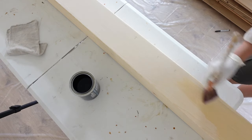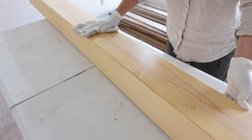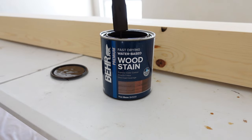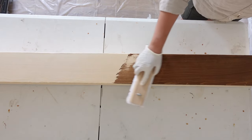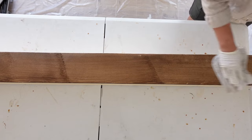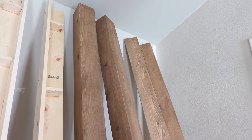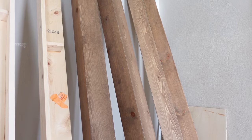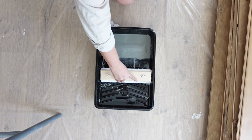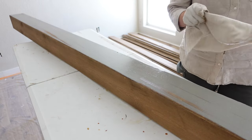After the beams are assembled, it's stain time. I'm using the same method as I did with the tongue and groove — bare water-based pre-stain, and I ditched the blue staining pad for a brush. It's way easier to apply and then immediately wipe after. I usually do one side at a time. After 20 minutes of drying, I stain the beam with Behr tamarind. If you didn't know, pre-stain has a window of use, so don't wait too long. I applied the stain with a Minwax staining pad and wiped off the excess soon after. You could do two coats of tamarind, but I only did one. Then I applied Varathane weathered oak — you definitely want to have the windows open and rush to wipe off the excess immediately, otherwise it will look too gray.